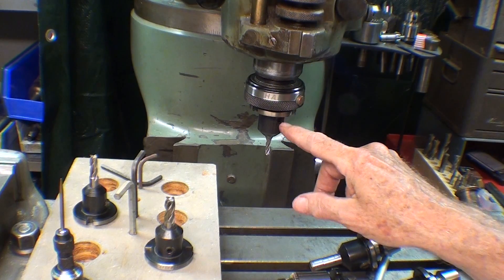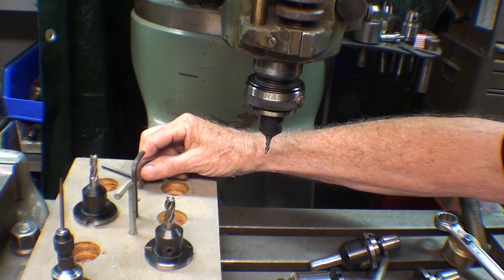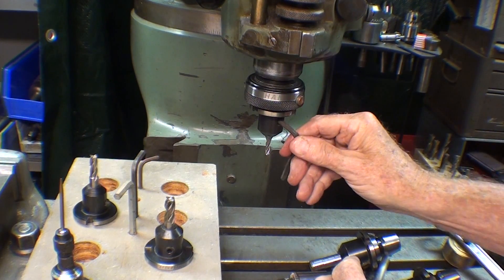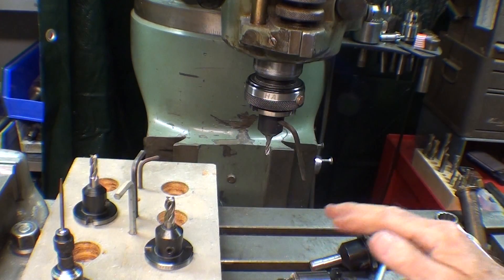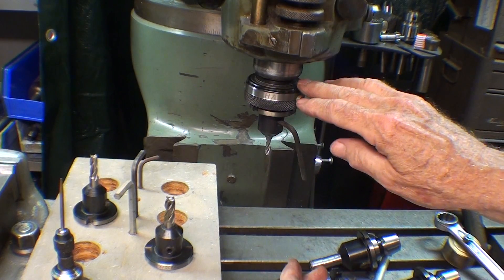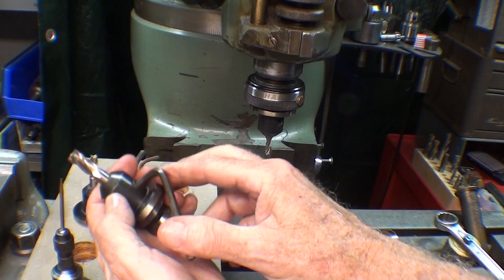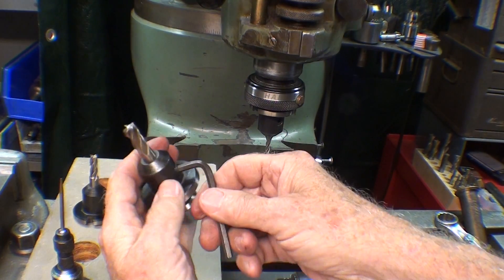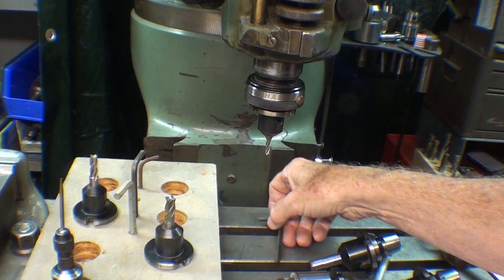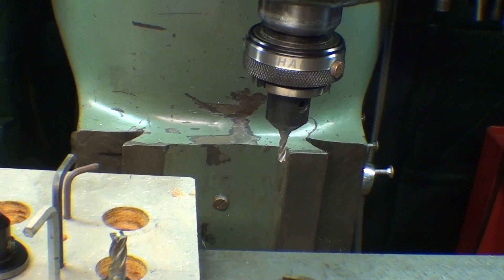Of course, to change the cutter within the holder, I have several different hex keys here. And using the appropriate one, you could go ahead and change it. It's much easier to change these when the tool holder is locked in the spindle than to attempt to do it by hand here, and you could cut yourself. Be sure and wear your safety glasses in your shop and practice all safety rules at all times. Well, I think that concludes this video on Royal Tooling. I hope you liked it, even though you may never have the coins to buy such an item. This is Tubal Cain saying so long for now, and I'll see you in my next video.